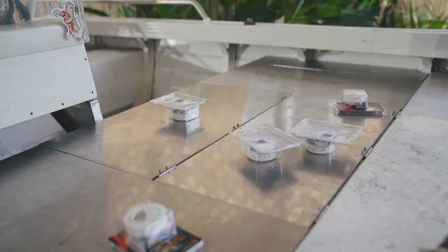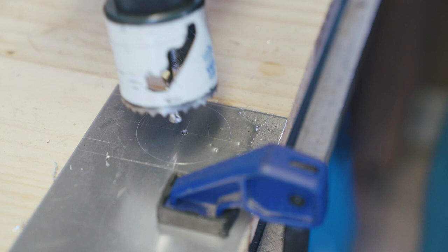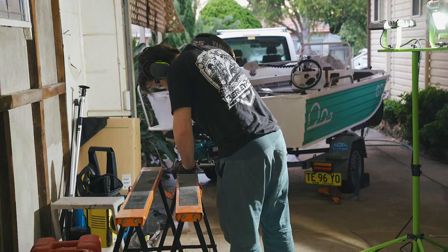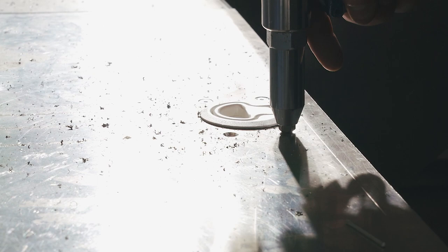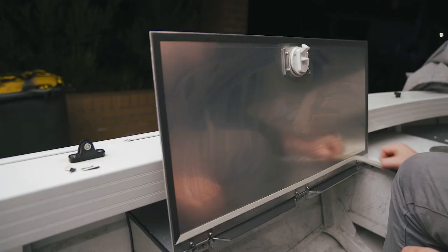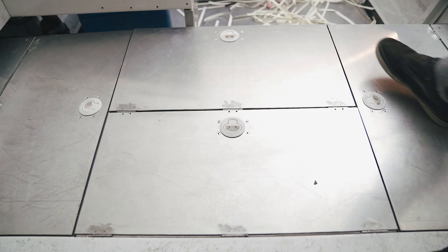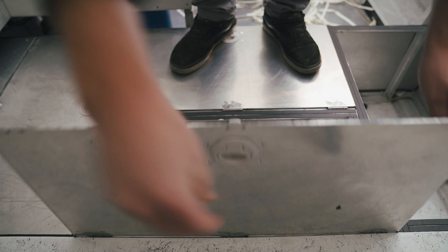Just like the front and rear deck build, I'm using the same hatch latches, but this time I'll show you the step I always forget to film. Because the ally sheet is so thin, a spacer shim is needed to fill the gap left in the latch stack. Using 4mm sheet remnants, I cut a small spacer shim and rivet it into the ally panel to effectively double the sheet panel thickness — this way the latch is much more secure. Without the shim, it's possible for the latch to float up and down and rattle in place. This is by no means a waterproof casting deck and was never intended to be, but it is possible to limit water ingress by adding a soft foam tape between the hatch lid and the frame. The slight thickness of the foam also provides a small amount of pretension to the hatch, which minimizes rattling and metal to metal contact when you're hauling ass down the estuary.